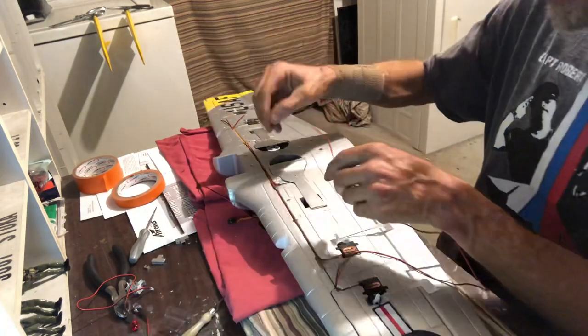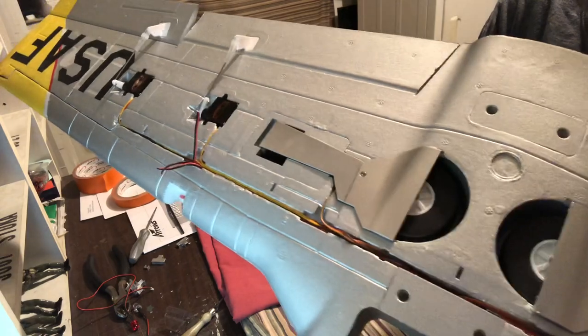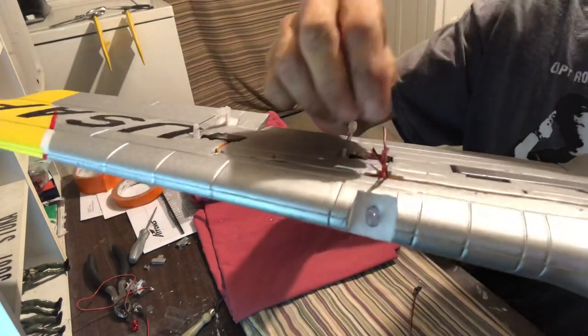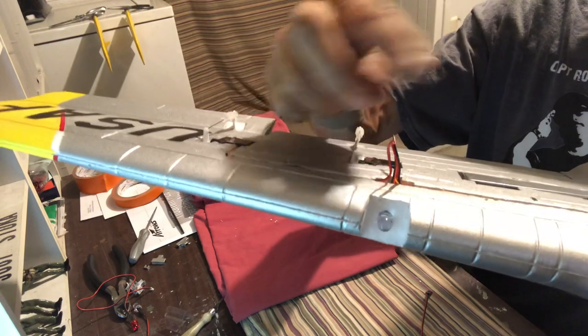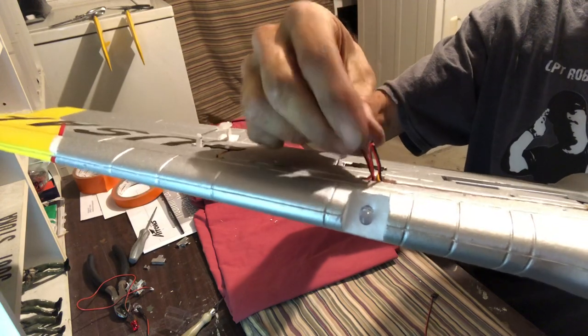Plug there and fit right down the same way the servo leads did. And it'll look like that. And you put them little tabs back in, but well, after I splice that in. All I did was make a little loop with the lead that comes from this way, a loop about 3 inches. And then the lead comes in from the landing light there, and I splice them in.